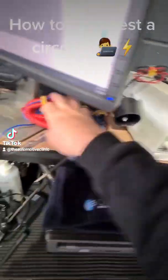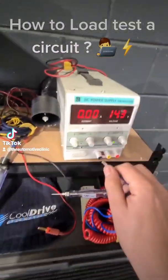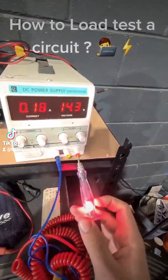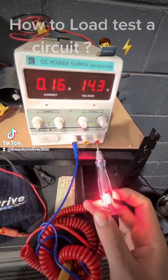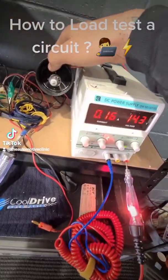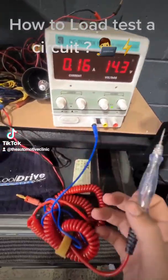So if we hook up another one — this little one here is just an incandescent test light — you'll see there's a massive amount of current draw difference. If we hook that up, we've got 160 milliamps roughly for the incandescent light. That's a huge difference to six amps.